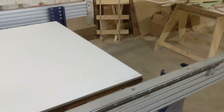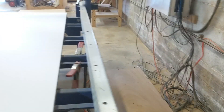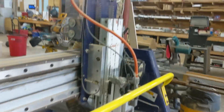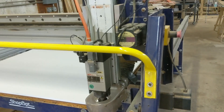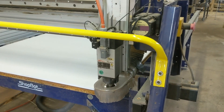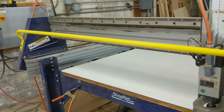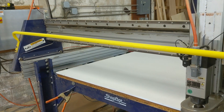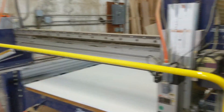Both of the motors are wired into a switch here on the wall, so when I want to turn the vacuum on I just flip the switch and it pulls the sheet down really tight. It's got a 2.2 horsepower HSD spindle — the original spindle; I haven't had to do anything to it. Next to my shop are grain silos, and a year or so ago lightning hit the top of them and blew out one leg of the three-phase power coming in. It blew out a computer, one of the proximity switches, and the spindle speed controller for the VFD. Ever since then I've been manually zeroing X and Y by pulling it against the stops, and I adjust the speed with the buttons on the VFD. I'm used to it, and one of these days I'll probably fix it, but I'm not in much of a hurry.